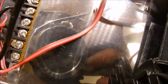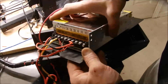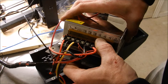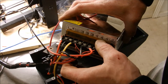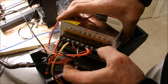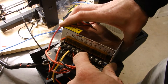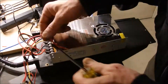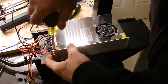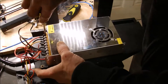Next I'll open up the power supply — two wires, positive and negative right there. As you can see, there's a V-plus and a V-plus, and a common. Common is your black or your negative, and V-plus is your red or your positive. I've got an open terminal there and an open terminal there — those are the ones I'm going to use.